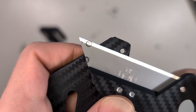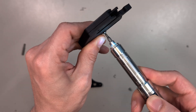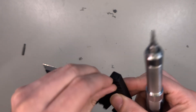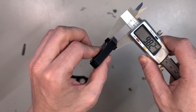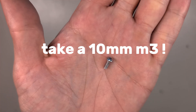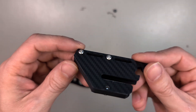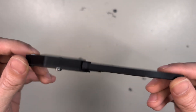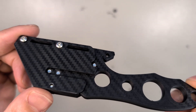Before we need the screws, we first clear the excess material around the pre-cut holes. For the sheet we need four M3 screws with a length of 4mm. I then screwed them in from both sides on the lower two holes — just make sure that you don't over-tighten them. The last one is at the top, and if my calipers are right, this is a bit short of 10mm. I don't know why, but I grabbed the 8mm one. One with a length of 10mm would of course have been the better choice. In my opinion, this is a very suitable part for using a textured print plate, because you have the pattern on both sides of the sheet. I will change that 8mm into a 10mm one, which is a better fit.